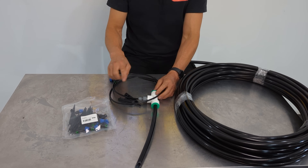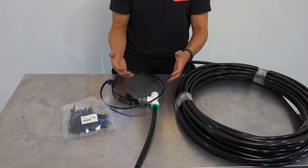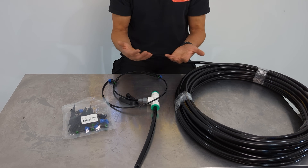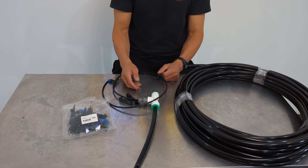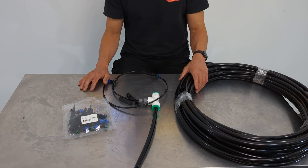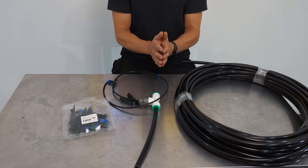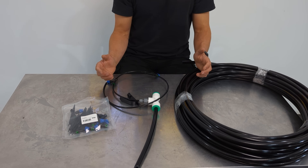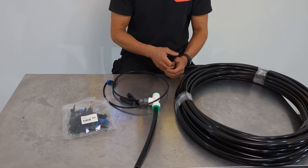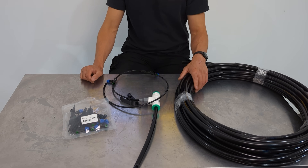In our workshop we use these fittings for compressed air — these PPR fittings can handle hundreds of PSI, so they're really ideal for very high air pressures. With a half inch thread, most pneumatic fittings will attach as well. We're also doing a DuoTight Generation 2 fitting — all new DuoTight Gen 2 fittings are made from UV-resistant polyketone rather than the previous acetal, so those new Gen 2 fittings also have the ability to be used outside for extended periods.